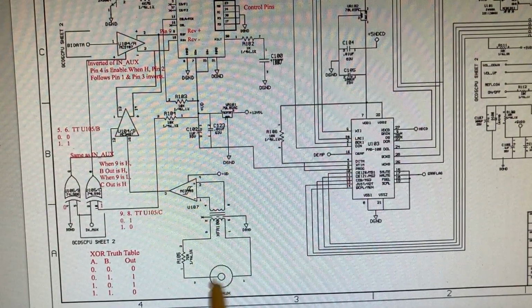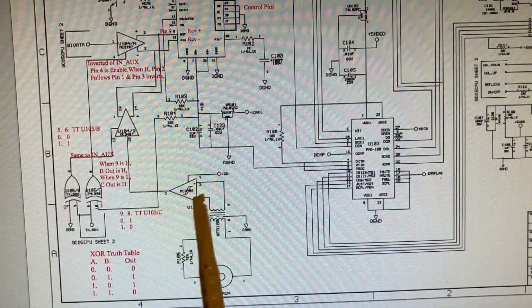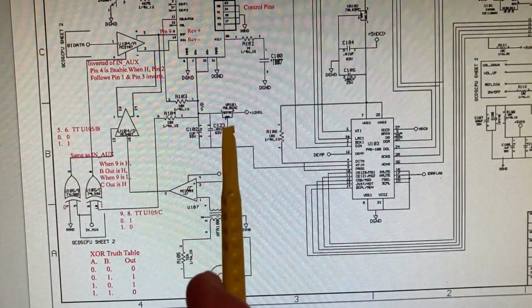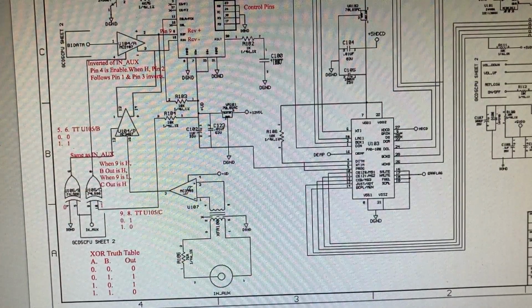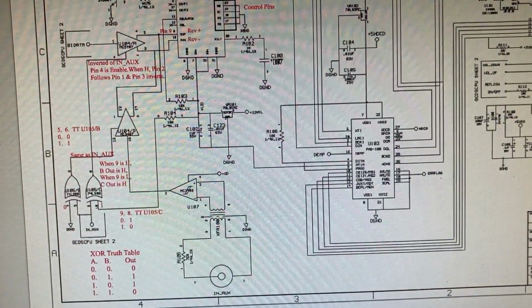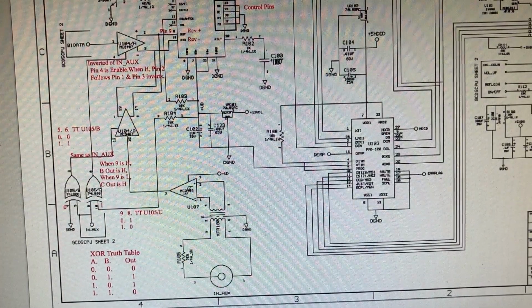And just to make sure that the voltage regulator itself wasn't somehow breaking down in circuit, under load, I went ahead and swapped out this chip, and this regulator. And sure enough, now we've got plus 5 here, and the unit works fine. It easily switches between the auxiliary and the built-in transport. So, next video, I'll just show the unit in operation briefly, but she's up and running, sounding great.